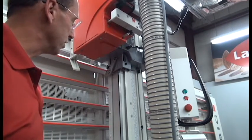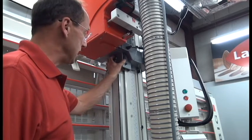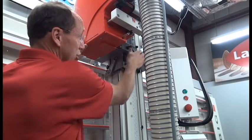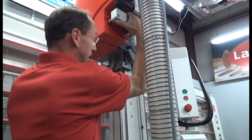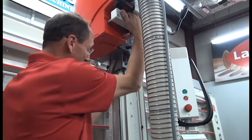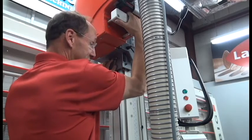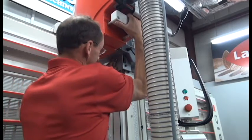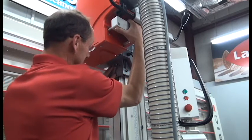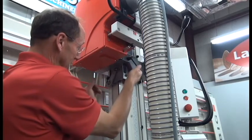To test whether your carriage clamping mechanism needs adjusting or not, you can lock your handle and simply pull down on the carriage. It should be able to hold — even properly lubricated, it should be able to hold your body weight, 150 or 200 pounds anyway. I've intentionally put this new machine out of adjustment so I can easily pull down on the saw head even though it's supposedly locked.